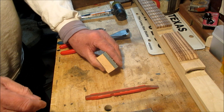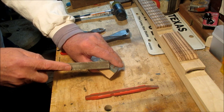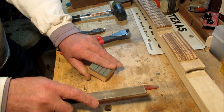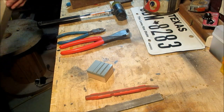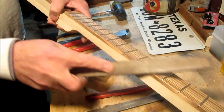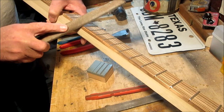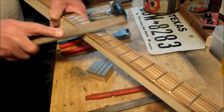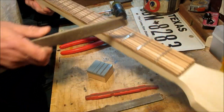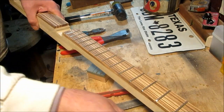If you're not going to use a belt sander and you're going to use a file instead, what you want to do is avoid working one fret at a time. Use a file that's big enough to cover a number of frets and lay it across the board like this. I can run this whole thing along the side. Again, I want to count my strokes and make sure I'm not hung up on one spot, because the more you address all of the frets, the more likely they are to be uniform. Lay your file diagonally as much as possible so you hit as many frets as possible.